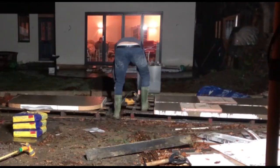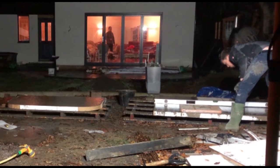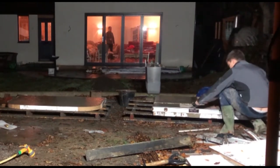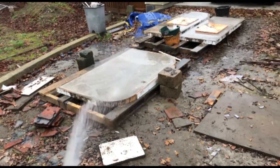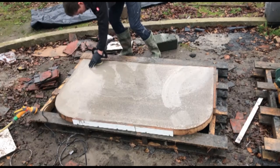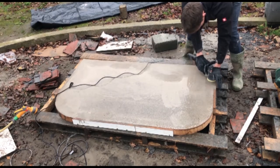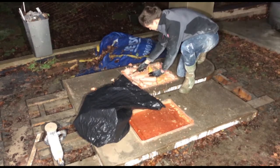You can then use an SDS drill on hammer mode to vibrate the edges further, then make sure all of the molds are flat and level. Leave the concrete to cure for two to three days and keep them hydrated. Then using a good quality machine polisher and a 50 grit stone polishing pad you can flatten off the backs of all of the worktops. You can find a link to both of these products in the description below.